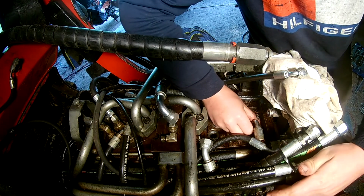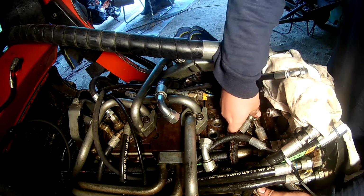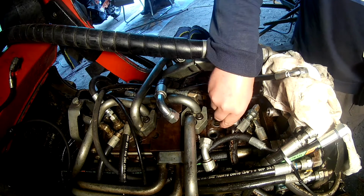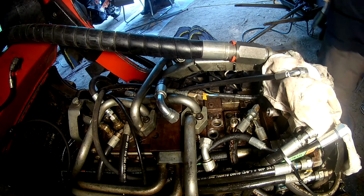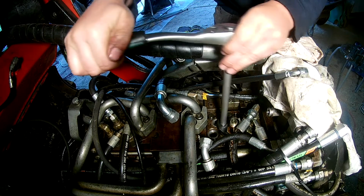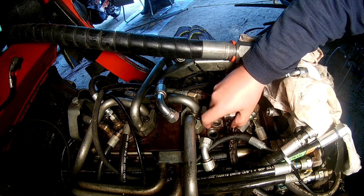And there is a spider web of hoses here that needs to go back in place, and I had taken care keeping track of where everything went and taking a few pictures before and after. And here I was too quick at installing the hose, so I couldn't get access to the adapter, but luckily I had those crow's feet that you don't use very often, but every now and then they shine, so it could be tightened without removing the hose.